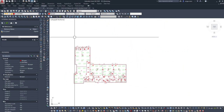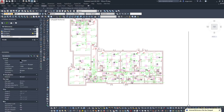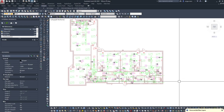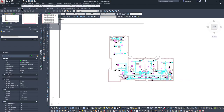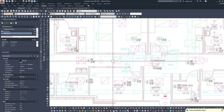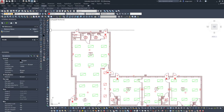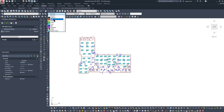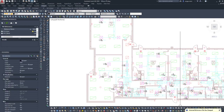Saving and going back to the drawing. You'll usually get a notification that your xrefs have changed and ask if you want to load the latest versions. I didn't save my mechanical one yet — there it goes. Now my mechanical is cyan and my fixtures, instead of green, I'm going to isolate them and make them yellow. Isolate and save, go back to the drawing, and reload them.